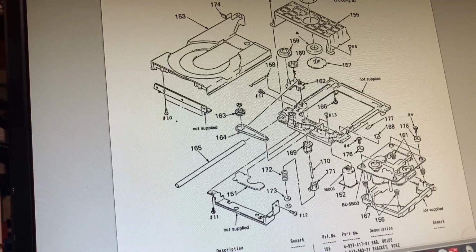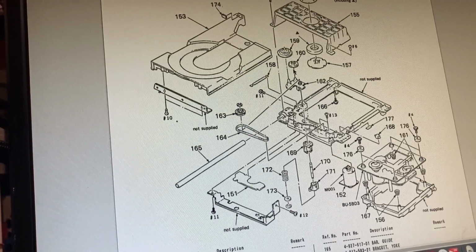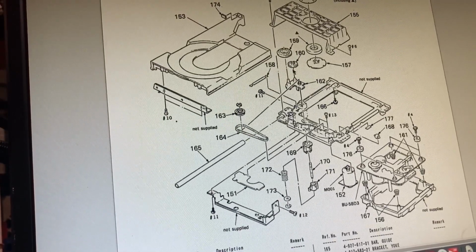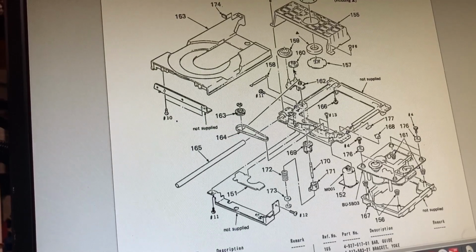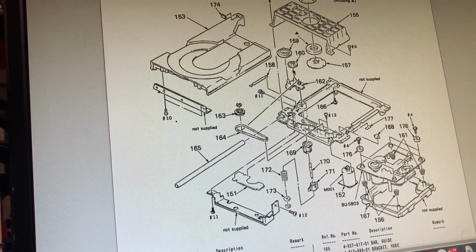One is one of the flex flat cables, so that's certainly something to be very careful with. Those things are pretty vulnerable. So my recommendation is just use 2 hands to install it back in. Put your thumb and forefinger on each side and just press it down firmly, but make sure it's lined up before you put any pressure at all.